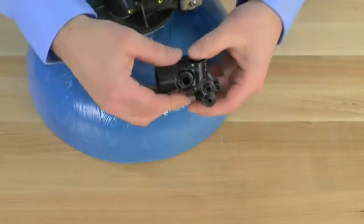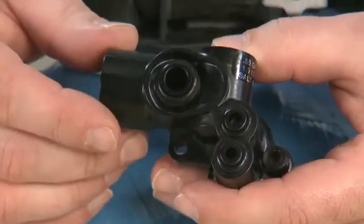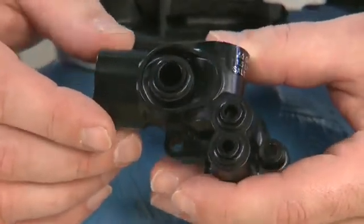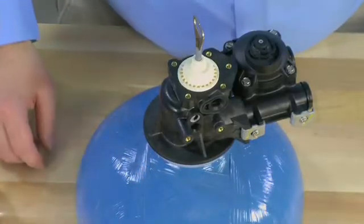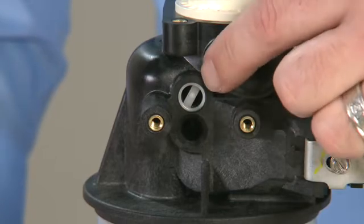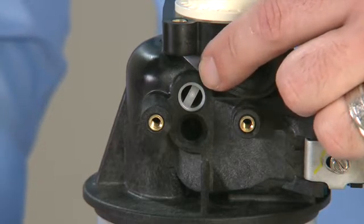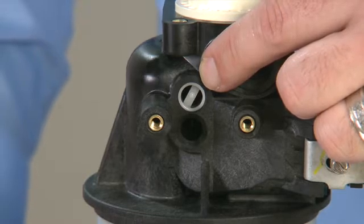On the back side of the injector assembly, there are 3 O-rings that seal this to the body. Make sure to check these and re-lubricate during assembly. We then move over to the body. In the openings where the injector are, there is a lower and an upper. The upper should have the white flow disperser. This is opposite where the injector assembly is.